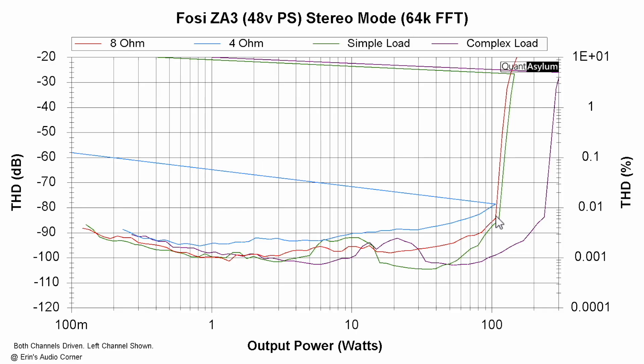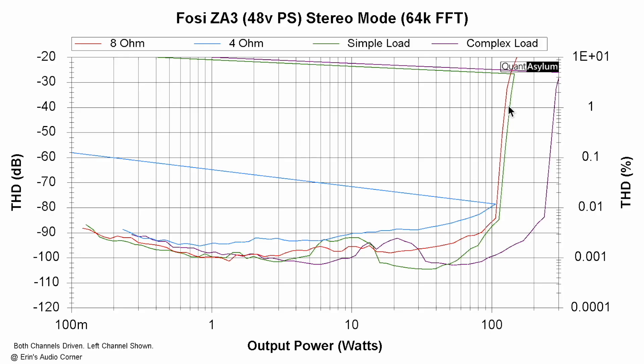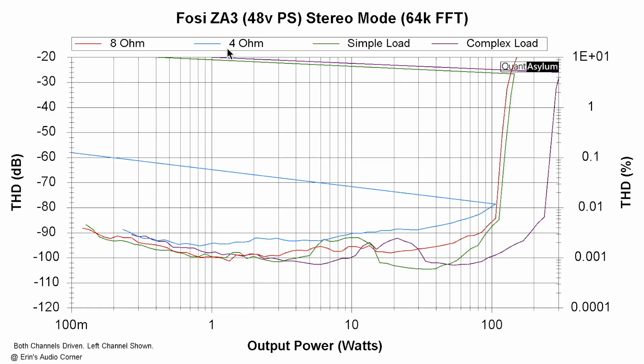The 8 ohm rating is 95 watts at 1% THD — and at that point it actually does better than rated, which is cool. For 4 ohm, rated at 180 watts at 1%: the light blue line ramps up and at about 105 watts it shoots over and goes into protect. I found this really weird since it's supposed to be 180 watts. I've seen other measurements showing it goes above 105 watts. So what happened? I did two days of investigation.